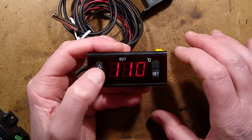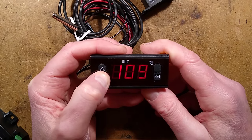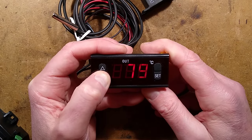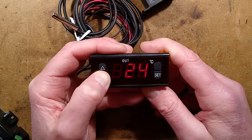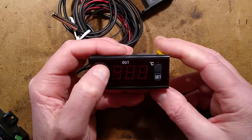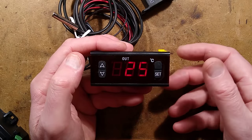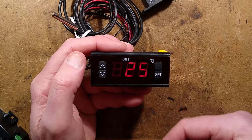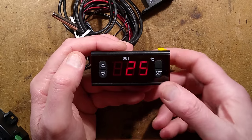E2 is the maximum temperature the user can set. I'll make note of all these in the description. For example, if an office worker who feels the cold is allowed to set it too high, they'll run it up to 100°C and the heater just runs all the time. So you set a maximum cap — let's say 25°C.